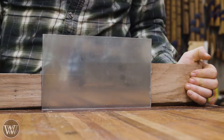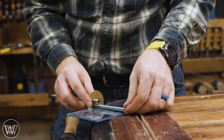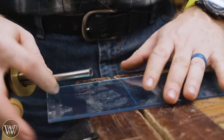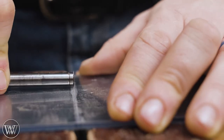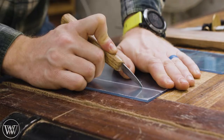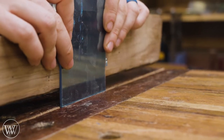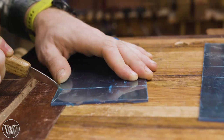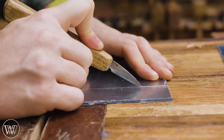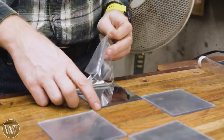I keep the protective film on both sides so that it doesn't get scratched up too much while working with it. For the actual cutting, I need to score both sides of the plexiglass and then put it in the vise right at the height of that line and snap it off. For the first one I marked it out with a ruler, but then I found I could mark it off a little bit easier with the marking gauge. I can come back in with a knife and score the marking gauge line a little bit deeper — the score gives a track for the knife to follow, making it fairly easy to cut that line all the way across and score it on both sides. You have to be a little more careful with smaller pieces as they tend to break off, so I find that using a board helps them go together a little bit better.